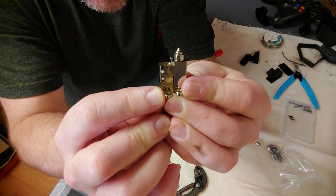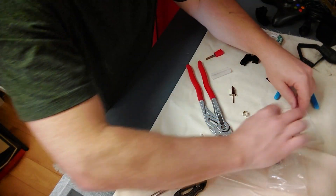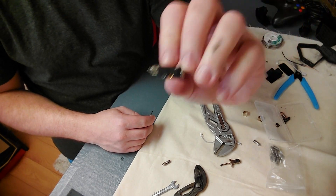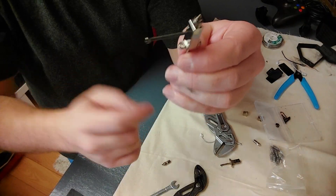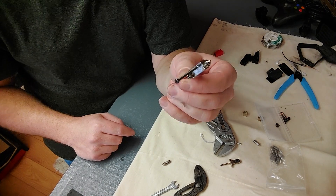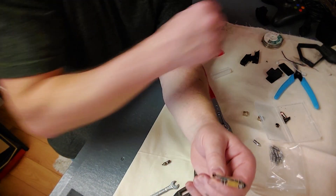You can see I knocked that off quite a bit. If I put that next to the original one, there is quite a bit of material missing. There's something else I noticed — this top hole, if you have a not completely messed-up nozzle, is actually threaded. And this bolt which holds on the heat sink fits — I suppose it's M2, because M3 does not fit.